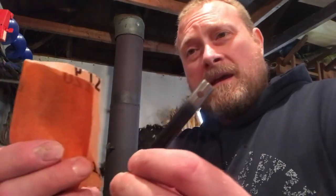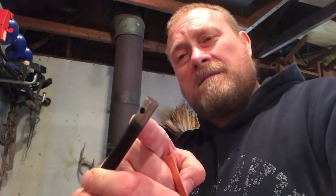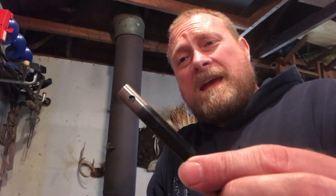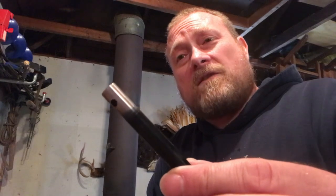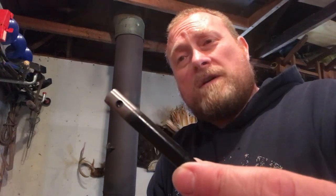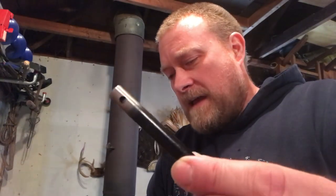Now, a little bit of the prep things on the ferro rods that have to be done. You take a little sandpaper and you sand the base where you want to go in. You want to go in about an inch on these antlers so they're strong enough to take the abuse of actually using these. And these lanyard holes, these are the end that's going to go into the handle. And actually, we are going to pack these lanyard holes right full of that epoxy, so there's plenty of epoxy in there when we put these into the antlers.